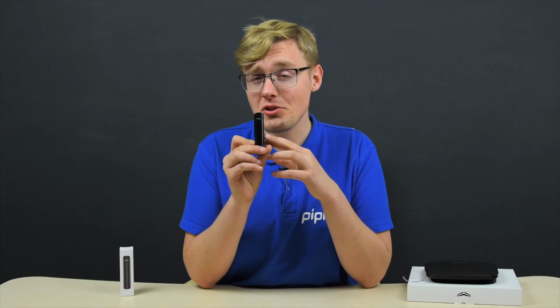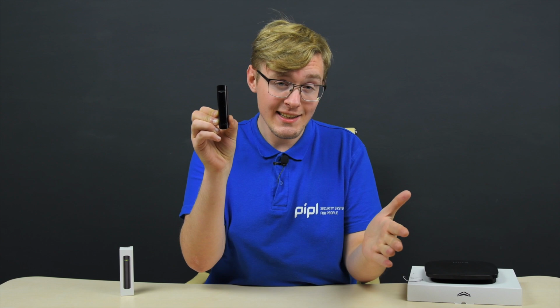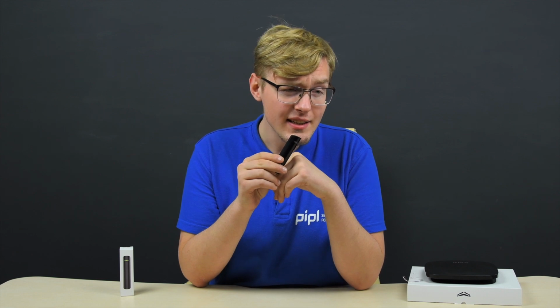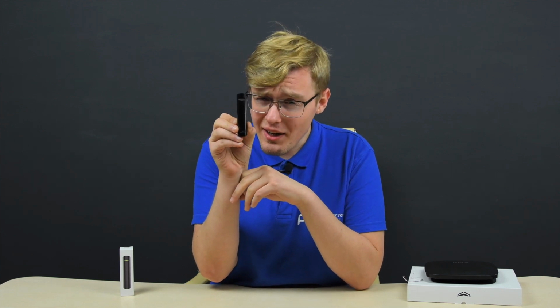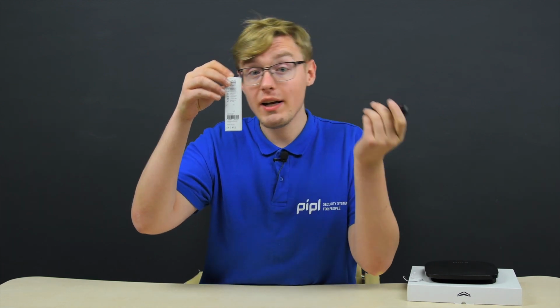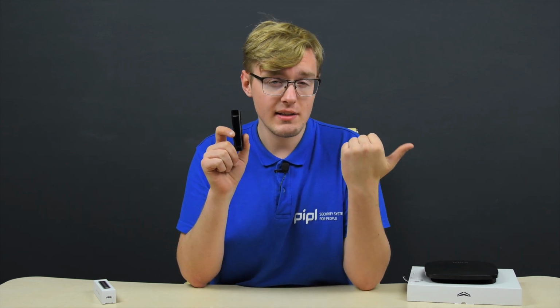Basically, it's a microphone, which you can tell if you look at the body. This little hole just discloses the whole sensor's intent, and it really looks like an Ajax DoorProtect to me. Ajax have also fitted in this tiny body an up to 5 years lifelong battery, you can see it over here, I think, and a radio transmitter and receiver operating under the Ajax Jeweller radio protocol on a wave of 868.6 MHz. Declared operating range reaches up to 1,000 meters. The ping frequency here is from 12 to 300 seconds, which is common among Ajax devices.